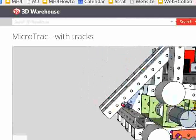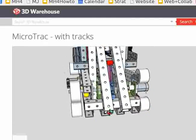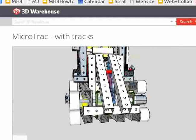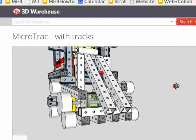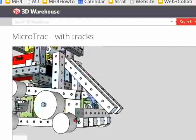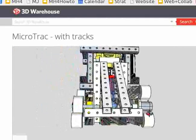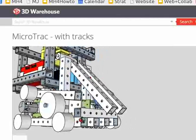Then we have to consider the loader cylinders, but I think we can figure that out. I think the single cylinder is quite sufficient at what we need to do right now, as long as you've got firm mounting and firm bushings, like the nice solid shaft, say that 1 7/8 inch shaft that we used before. So that's looking good. My only question would be the non-symmetry of the track mounting. You did that because it was necessary to mount the plates at a slight angle? Or can they be made higher for both of them and still be acceptable?